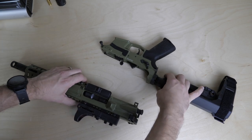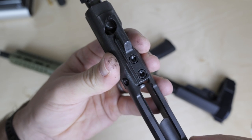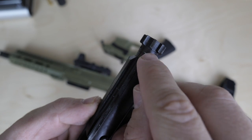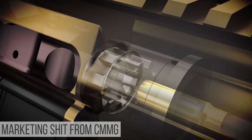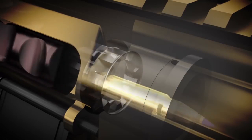Because of the radial delayed blowback system, it doesn't need to rely on a super chunky, super heavy bolt. In fact, this bolt and bolt carrier group look almost identical to a standard AR-15 bolt and carrier set. The radial delayed blowback system works via the bolt lugs — at the back they've got these little angled cuts. Those angled cuts require the bolt face to turn about 22 degrees in order to unlock during the firing sequence. CMMG's innovative and patent-pending radial delayed blowback operating system allows reliable operation without a heavy bolt, buffer, or spring. The mechanical delay allows pressure to fall in the chamber before it unlocks.